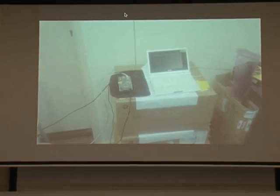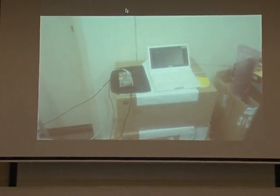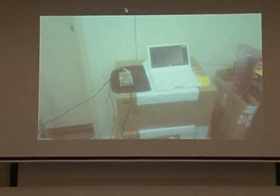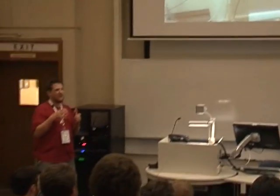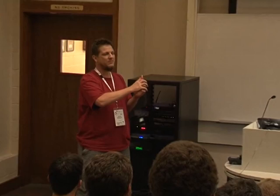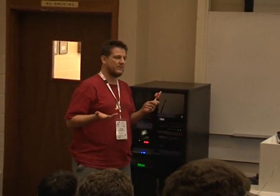So is there a microphone or some sort of feedback mechanism to the safe? There's a micro switch inside, and actually the coupler triggers the micro switch every time it goes round. And the way the container works, if you get the combination right, it locks, it jams. So the idea was we just listen to those switches, and if we stop hearing them, we must have opened them.